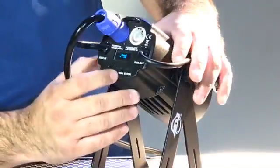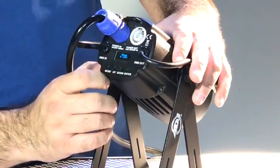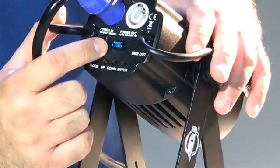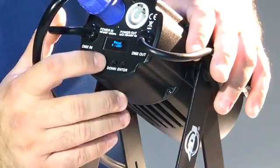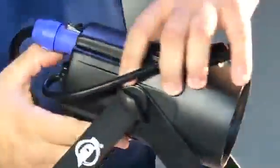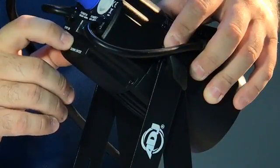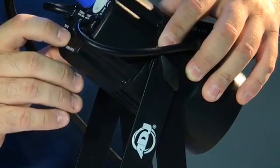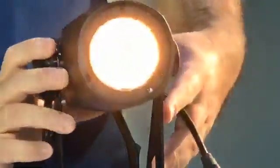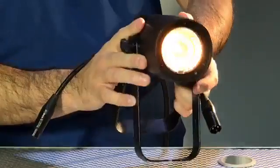And here I could actually show you what's going on when it comes to actually controlling the color temperature as we dim to warm. So right now we're set at 255. If I just go up 1 digit and go to 0, then we have no light coming out from the fixture. But as we do end up hitting the up button again and we get to 1 and continue to go up, you'll see that the color temperature is a nice orange. There you go. I'm going to keep on going up.